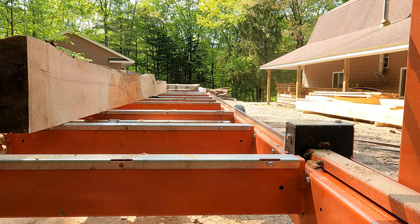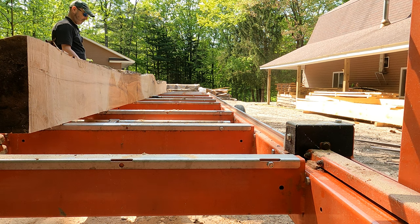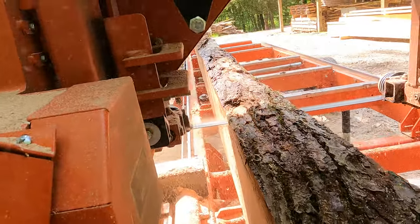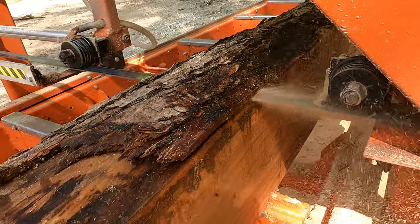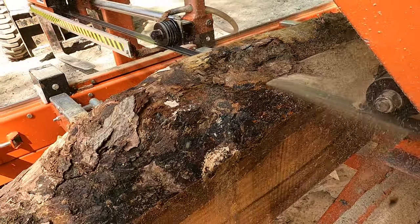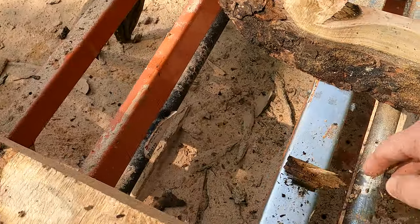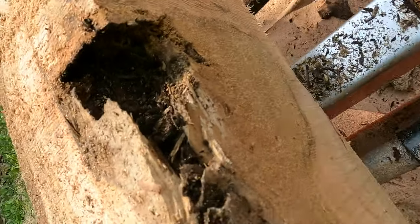All right, let's see what we got. 10 inch, 9 inch, 9, 8. So if I cut it at 9, I can get boards down to around here, and then I'm stuck at 6.5. This is why I couldn't make a beam out of it. It's all rotted in there. That wouldn't have worked real good.